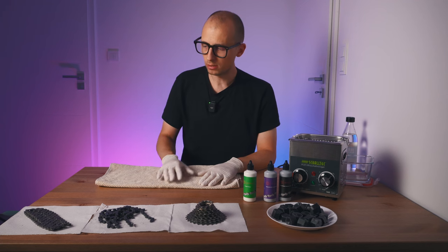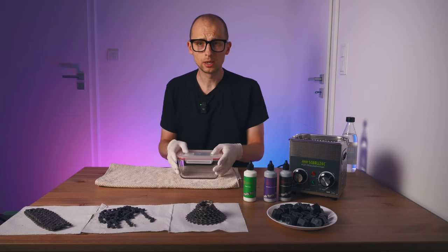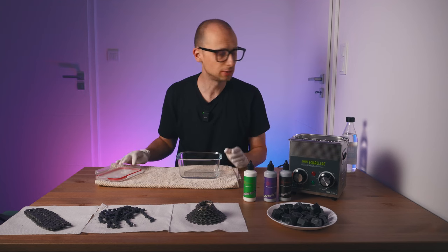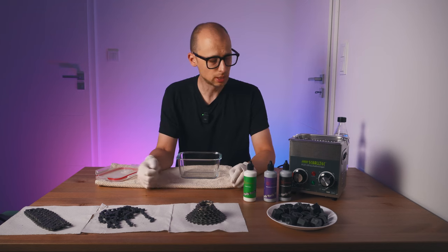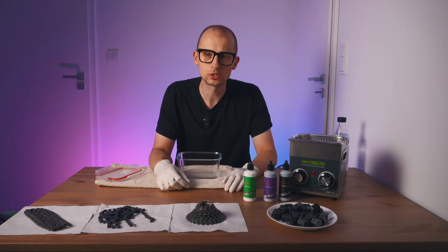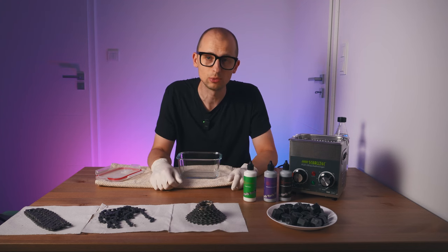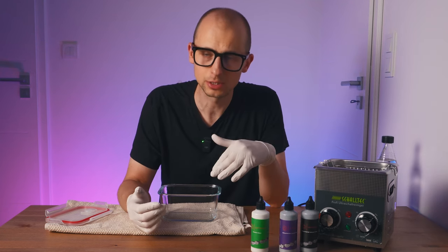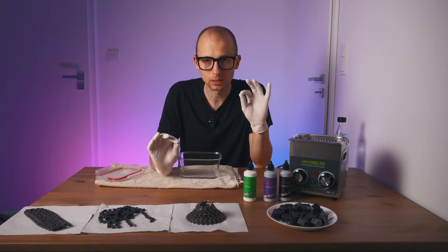To clean all those components, you'll need a glass jar or any kind of glass container that you can close. You'll need some kind of degreaser — you can use acetone or a brake cleaner. I'm using cleaning spirit. You also need your dirty components. I'm going to use an ultrasound bath as a finishing step so I don't have to use a brush to get into all the small corners. It's absolutely no problem if you don't have an ultrasound bath — you can use acetone instead to get all the grease off and get them perfectly clean.